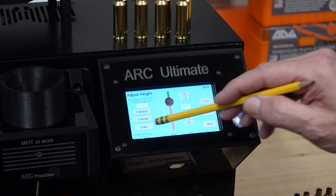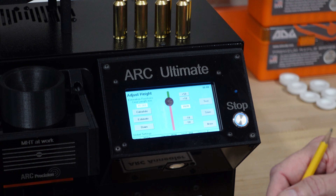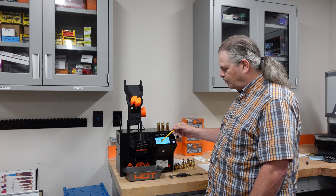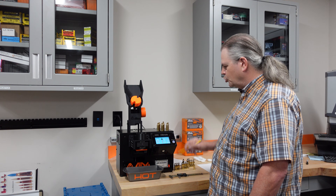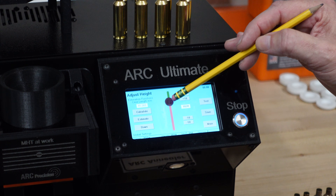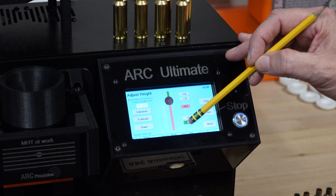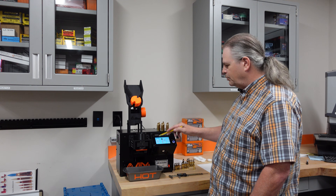Push the down button, make sure your bushing is in, then hit the test button and it'll raise up to position 1034. Hit save and it will store 1034 into the global settings — the values the machine uses when actually annealing. You can also adjust the height using the slider or the plus/minus 50 and 10 buttons. For Wildcats, I find it easier to just put in the measurement directly, or use the measurement from a cartridge chamber drawing for the length from the breech face to the neck-shoulder junction in millimeters.